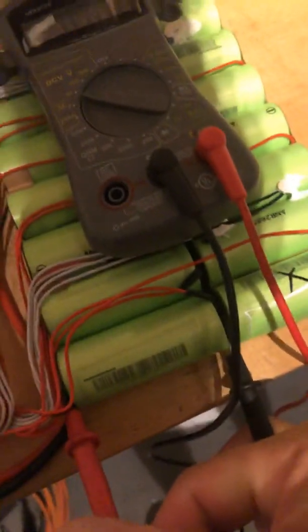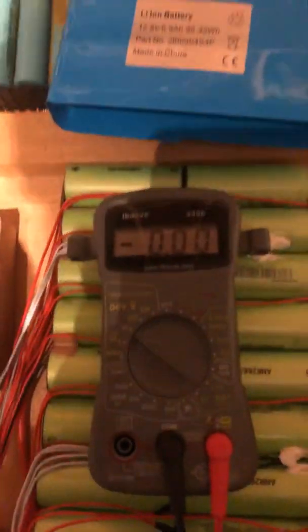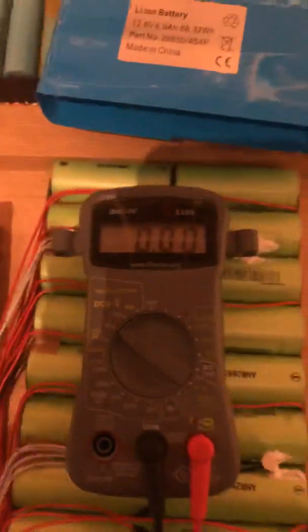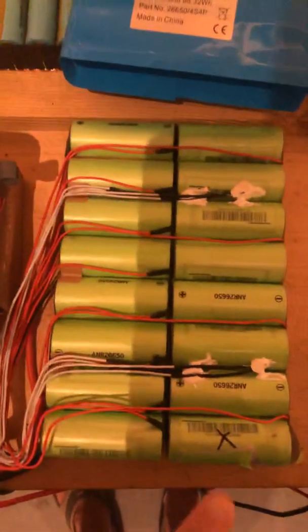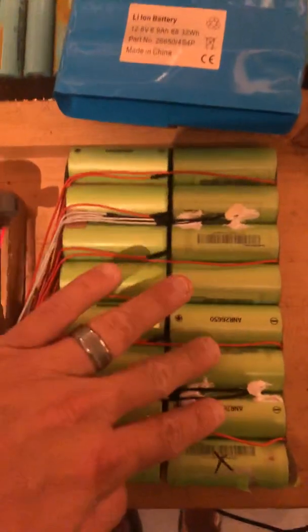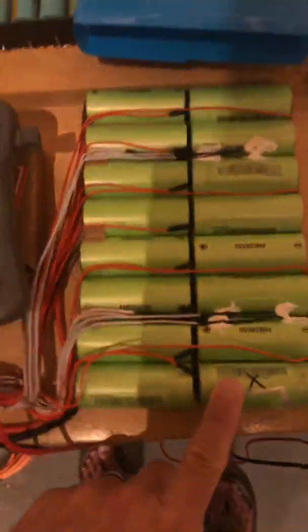You can see 3.24, 3.25 on this one. I'm on this one now instead of the bad one. If I pull those leads — I know this is kind of wonky, I've never actually done a YouTube video before, but I'm hoping this helps somebody. Essentially they're all reading 3.24 except for the one that was 2.61. I've tested all of them and this is the only one that's different.